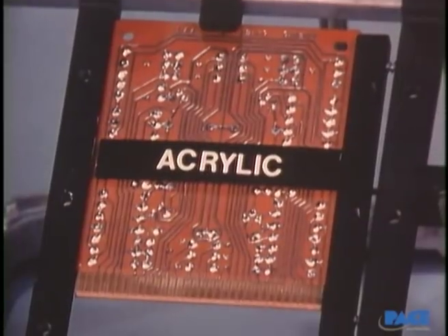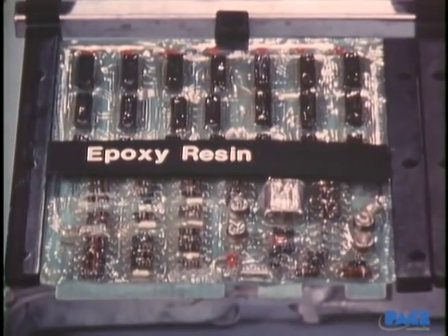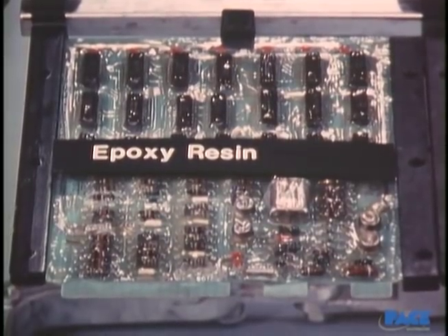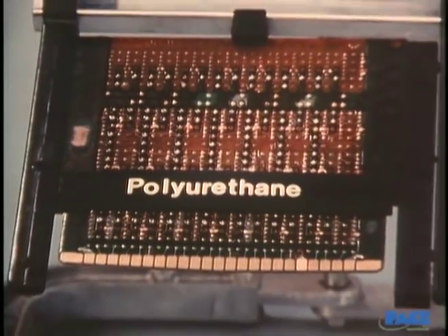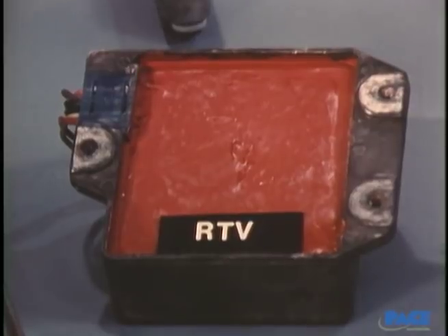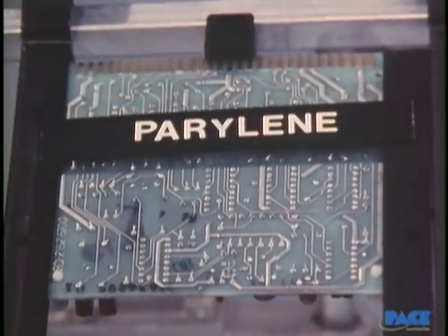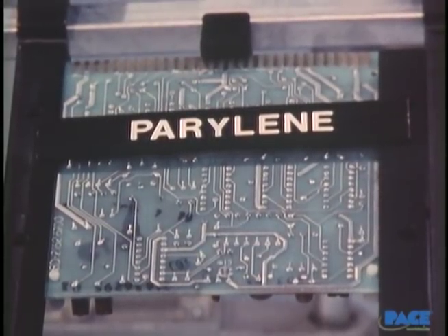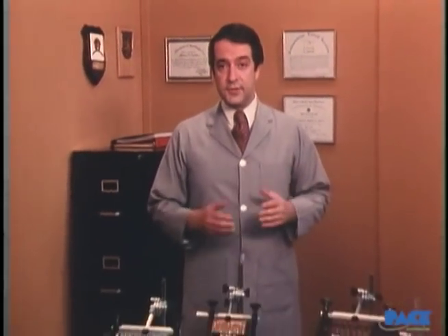In general, you'll be dealing with several main types of coating. Some of the earliest coatings were the acrylics and varnishes — not used much anymore, but they'll probably never disappear altogether. This one is an epoxy resin, one of the most common of all, but it's now being replaced by polyurethane. The polyurethane coating can be either hard or soft, and like the epoxy, either thick or thin. Here's one of the RTV silicone ones — synthetic rubber — primarily used for potting sub-modules. This last one is one of the newest and was specifically developed for the electronics industry: trade named parylene. It's always vacuum deposited on the board in a thin, hard coating, and it's very uniform and tough.